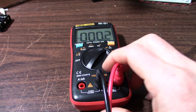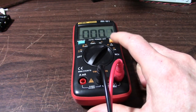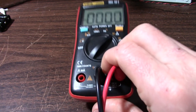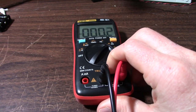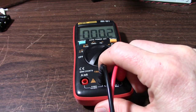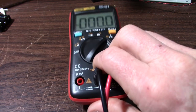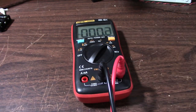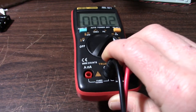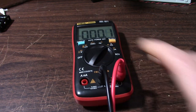There's one recommended hack I did to this meter: there's a lot of noise that gets on the supply rails due to its digital circuitry, which makes some readings slower to lock in. What I did is soldered a ceramic capacitor across the supply rails, and when I checked it with the scope it did significantly reduce that noise. To be honest I didn't really notice a difference in practice — I didn't perform before and after tests — but it was a recommended hack so I went ahead and did it.